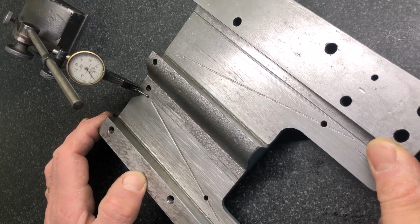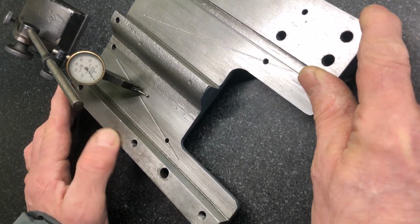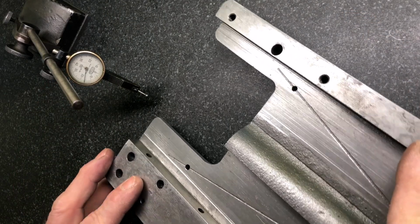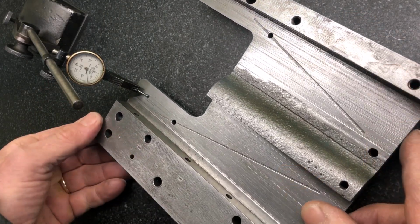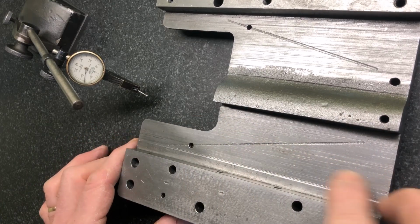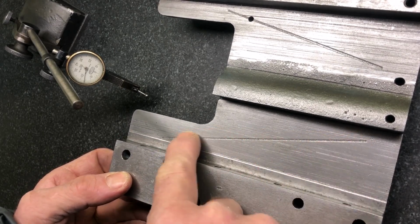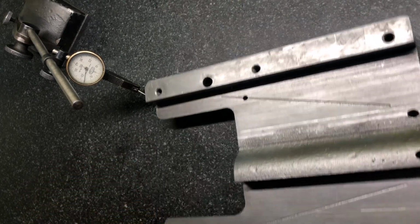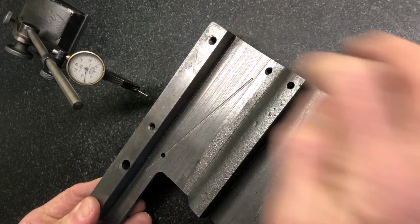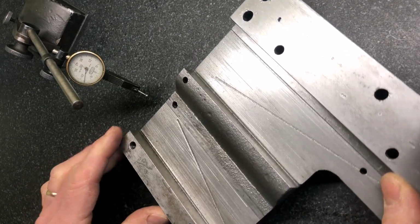And it tapers off to the rear actually. See, this is also unworn. A little bit, at least, on this side it does. However, as I said, not to be trusted fully here, because this is a little bit higher actually. Anyway, I measured that in another way. You can see also the wear here, represented by the lack of any oil channel, or this should be much deeper. And also the stripes, of course, hard to see in the light here, but quite significant stripes. So here is a saddle that is probably going to be milled down.